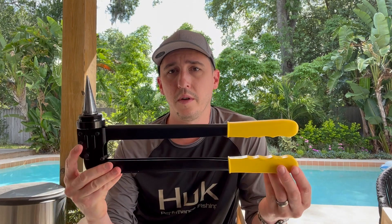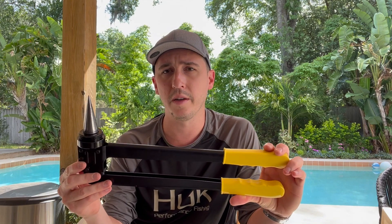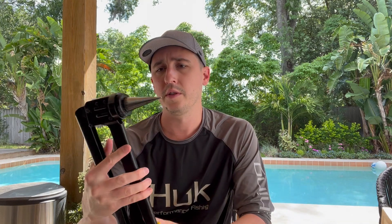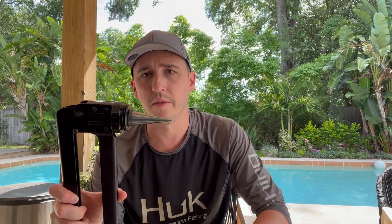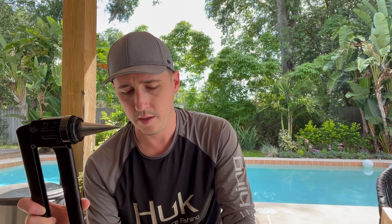This is the manual tool. I picked this up at Home Depot but you can get these on Amazon — I'll put a link in the description. Before you start, it comes with a tube of grease and you want to put just a little bit of grease on that cone there. Mine's already pretty greased up but just a little bit, wipe it around. This kit came with three heads: the inch head, three quarters, and a half inch.